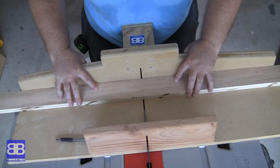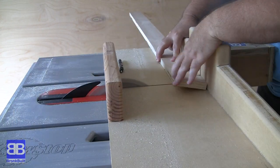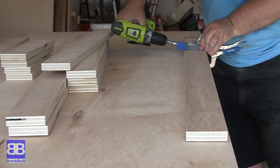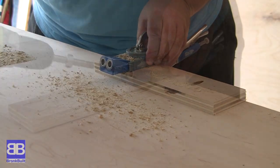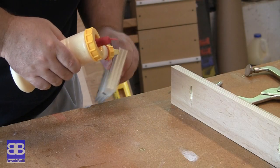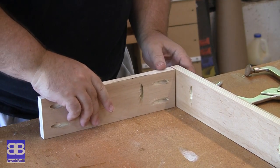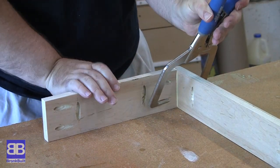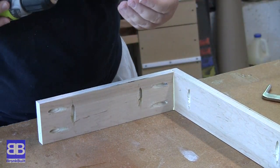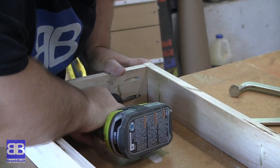You could use your miter saw just as easily for this. I'll leave a link to my video on how to build this cross cut jig in the comments below — it's easy to make and it is easily my most used jig. To assemble the base, I'm using pocket holes to attach the toe kick pieces together as well as to attach the top piece of the base. Start the base assembly by using glue and pocket screws on the toe kick pieces. The main thing you want to be mindful of is that you want all of the vertical pocket holes facing up — that's what you'll be using to attach the top of the base, which is the bottom of the cabinet. Each side of our closet will have two separate units, so I need to assemble two bases per side: one small one and one larger one.